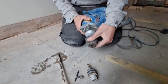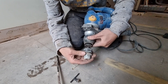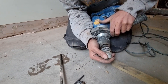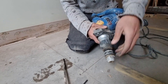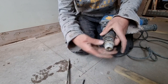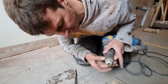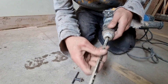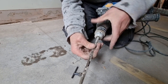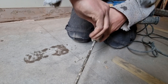On an SDS drill you can pull the collar back. So you want to pull the collar back, slot your SDS adapter in there like that, and now your SDS drill will just operate like it's got a normal chuck. It's only at that point you want to widen the jaws, put in your whisk, and tighten it back up. You can do it by hand and then just give it a final tighten with the chuck key.